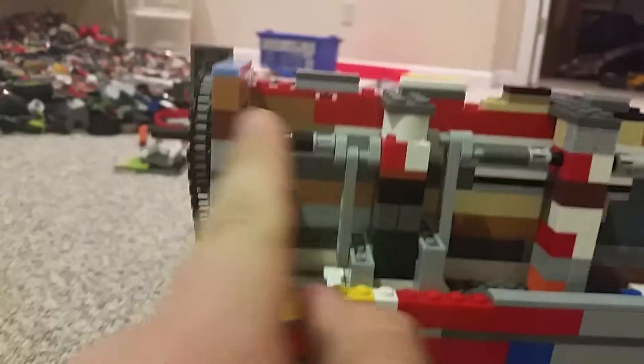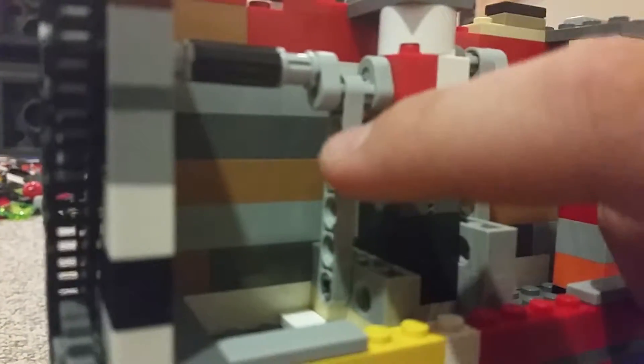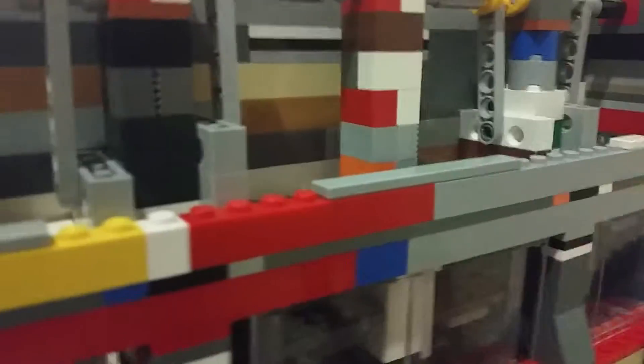Before I run it, I just want to mention that in the previous video I said this wasn't a true overhead cam — that's true to an extent. The way an actual overhead cam works is the camshaft sits up top, and it has these little throwout lobes. They don't connect to the piston — instead the camshaft pushes down on a rod, similar to this, which is basically the valve, and then the valve opens inside the cylinder — that's how intake goes in.